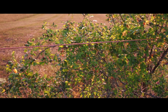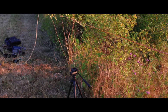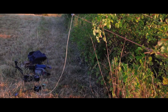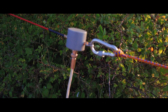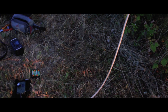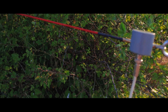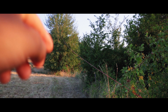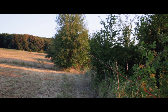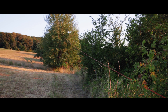Here's the antenna setup: I have the wire that goes to my impedance transformer, from here with a coax cable I go straight to the uSDX, and then the wire goes all the way up in that tree — about four or five meters high, no more than that. The SWR looks good.